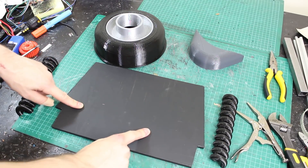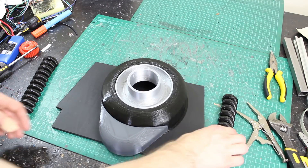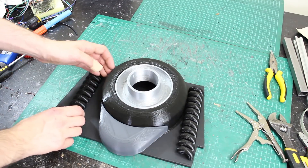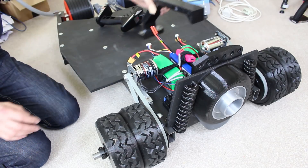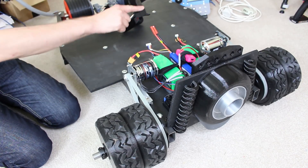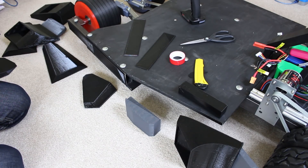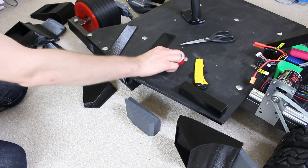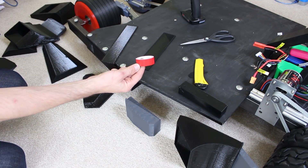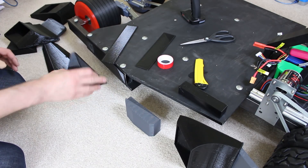So the back panel is going to be made of this bit of plywood and I'm going to glue on the features, and then we're probably going to screw them on at the back just to make sure they don't get knocked off as I ride along. This fits on the back here and this piece braces it to the chassis — it screws on the bottom and gets glued on there. I've already stuck on some panels here which are 3D prints. I've stuck those on with 20 kilogram holding force red tape, and that gives me something plastic to glue the cosmetics to.